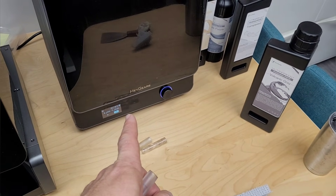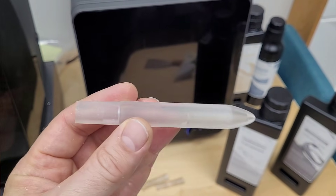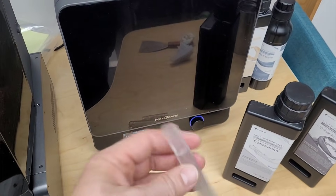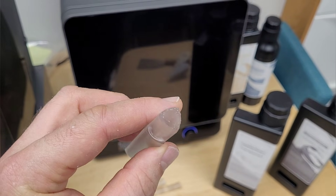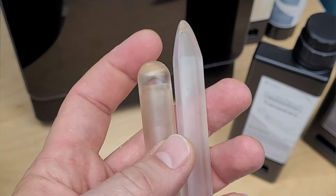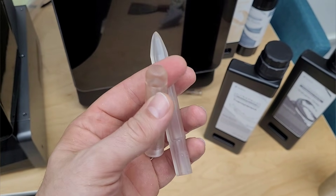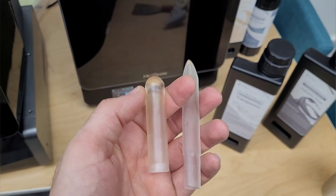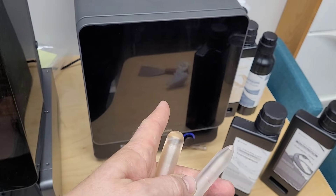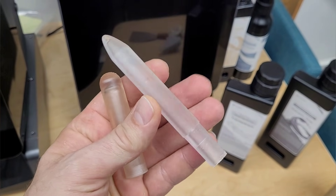It's going to let this run at 46 degrees Celsius for one full hour — quite a long time, not something I would have done on my own in manual mode. I uploaded the profile to the washer and it did a very interesting wash cycle, and then uploaded it to the curing station and it did a cure I thought was very different from what I did the first time. On the left is when I set the curing profile myself — it turned out quite a bit yellower. The automated profile ran for actually a lot longer, but controlled the temperature and settings exactly right, and the result is much better.